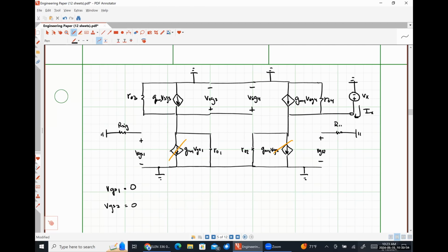All right, so what I'm going to do now is, let's see, I have a resistance of R01 that is between this node right here and ground. So I could just as easily say that this is R01 in parallel with R03, and R02 is between this node and ground. So I could put an R02 up here. Now, that is going to take that guy away, and take that guy away. I don't want to accidentally count it twice.